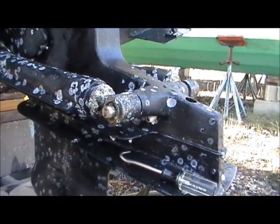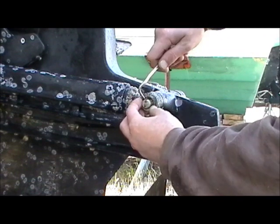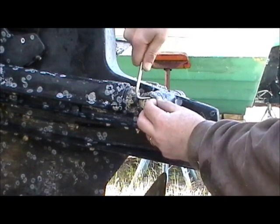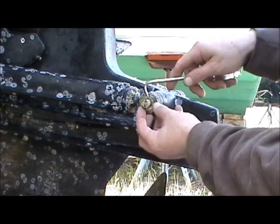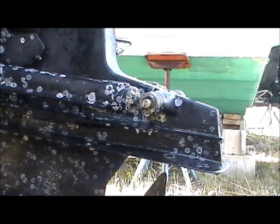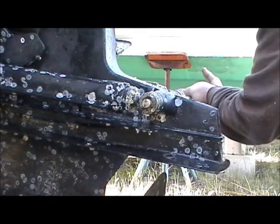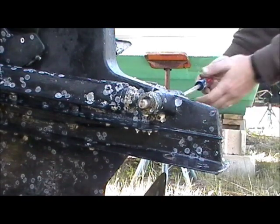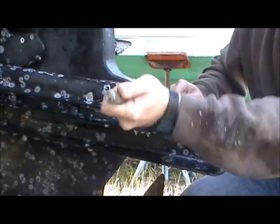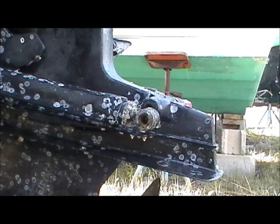Getting to these trim mechanism anodes — there are two, here and here — I'll show you how I do it. Just take a cotter pin extractor and pull that off gently. You should find a washer there; do the same on the other side. Then just take a big screwdriver or use your fist — I use my fist because I'm manly, hurting myself in the process — and get that sucker out of there. There was a dead worm in there, which is pretty gross.